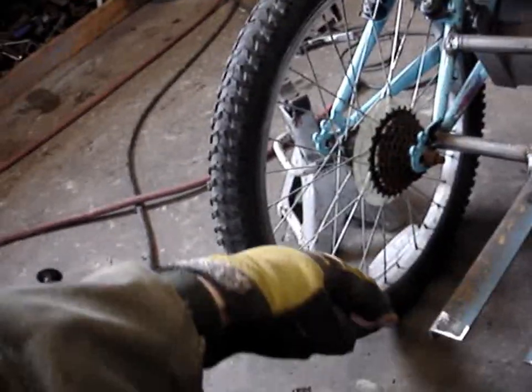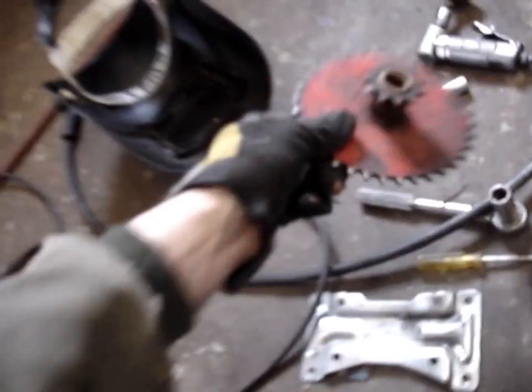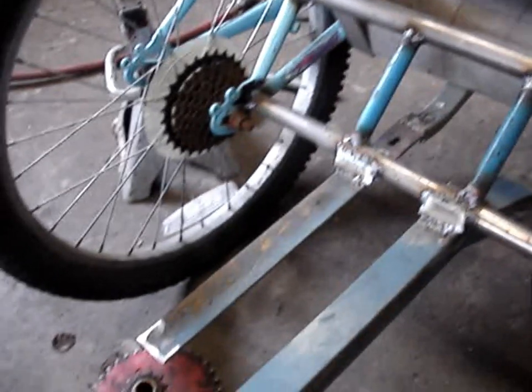I'm going to make another brace in the back here, going up to probably here to kind of triangulate it. And I gotta drill the holes for the engine. Just gonna use a regular clutch. And I got this gear. It's gonna go down in here somewhere. I'm gonna make the jack shafts. I got smaller sprockets to go to the wheel. I could use a number 41 chain on those, I think, so that's what I'll do. And then adjust it from here.